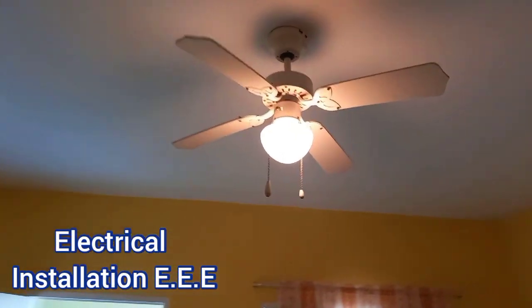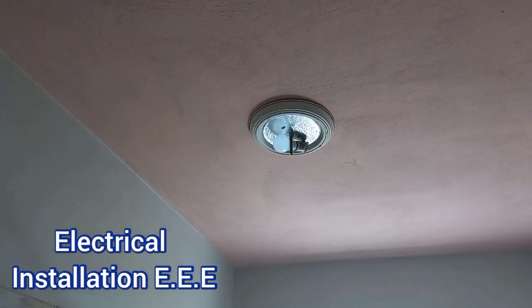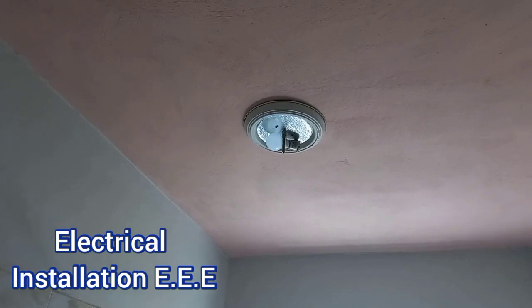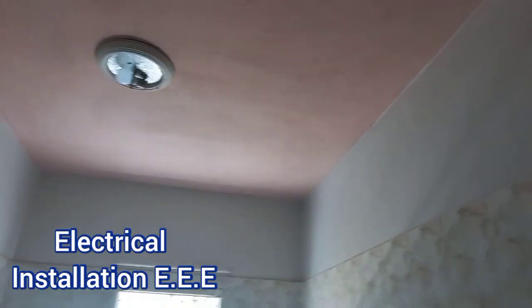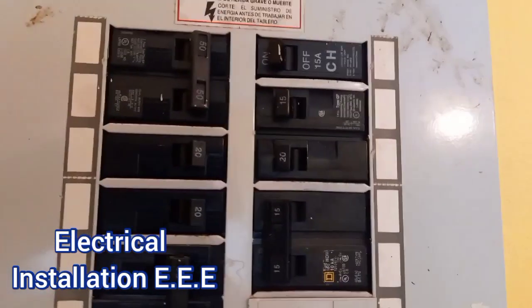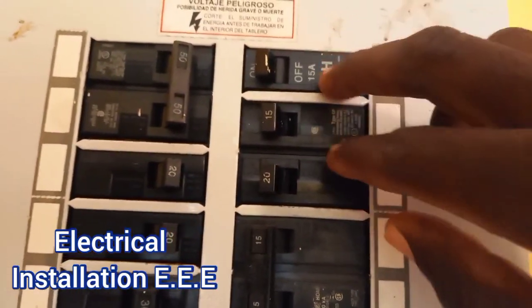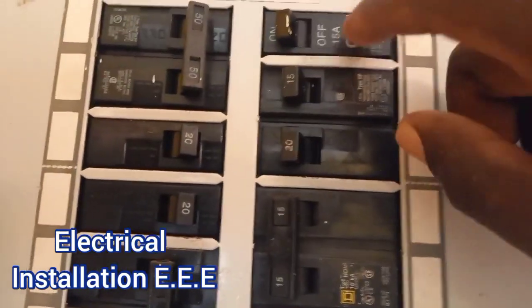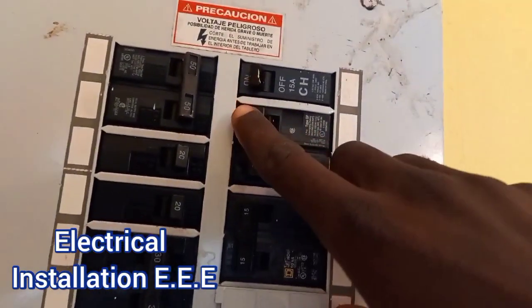Right here we have this light looking quite fine to me, but they're complaining about this light. You can see how much blinking — that doesn't look good. I'm gonna go over to the breaker panel. We have two different 15 amp breakers right here, so I'm assuming this D15 should be on, meaning there should be two light circuits. I'm gonna test them.